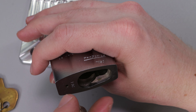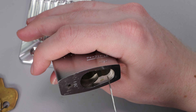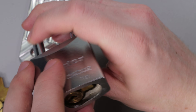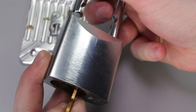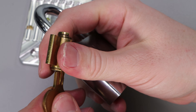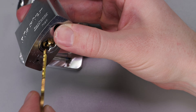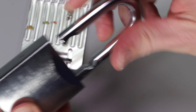Then you're going to want to take your actuator — the pointy bit on the top here — and just drop that right down and push it in. The next thing I want to do is insert my lock cylinder. I'm going to want to make sure my cylinder is going to sit all the way in the lock. So what I like to do is put my key in, just kind of maneuver it, make sure it's going to work and it's going to open the shackle. Now my cylinder is nice and secure in there. I'm going to drop that cylinder in one more time, then put the front faceplate on. It's going to be a little bit easier just to hold the front plate over it, turn, pop open the shackle, remove the key, and then secure the front faceplate.